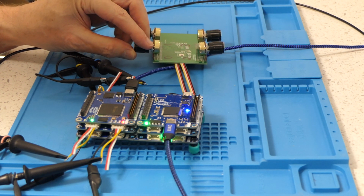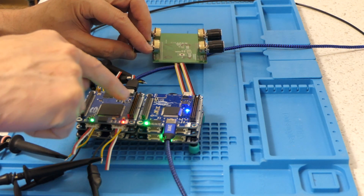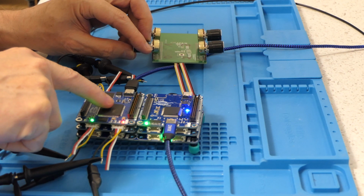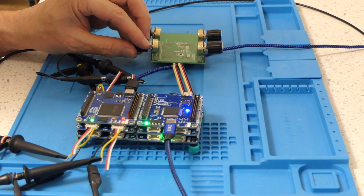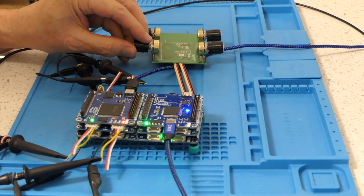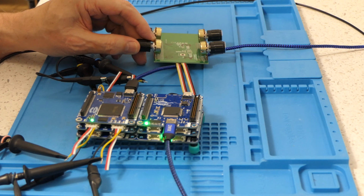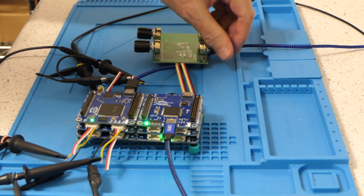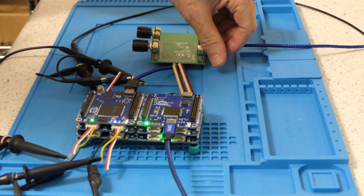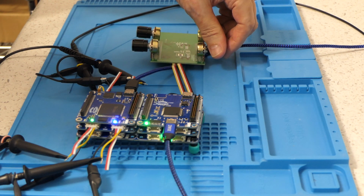So I got the 4 timer outputs. They pass through my bus system here to the FPGA, and then the logic is real simple. It's just pass through logic to the LEDs. And implementing simple little logic like that allows me to verify my tool set, and not so much tool set, but my design. Make sure it's all wired right.